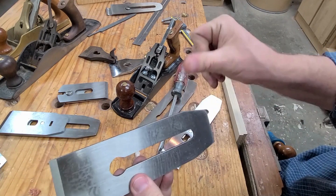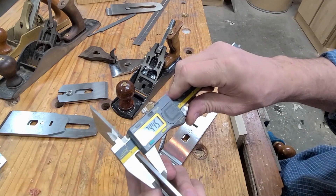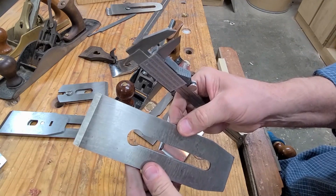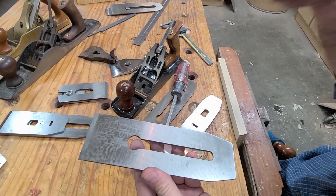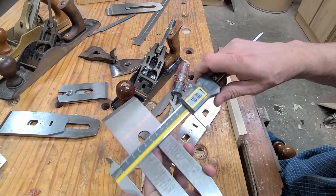The first class of blades is the Taytools Basic brand. This thing is super thick — it's 0.13 inches, so it's thicker than an eighth of an inch. Rockwell hardness is between 60 and 62. We have them in either two-inch wide or two-and-three-eighths-inch wide. You can use them in a number four or five, or the wider blade in a number four-and-a-half, five-and-a-half, six, and seven.